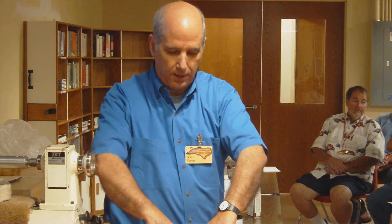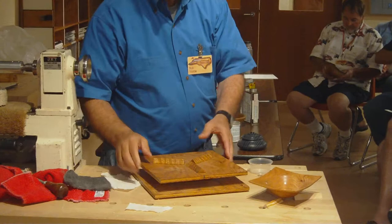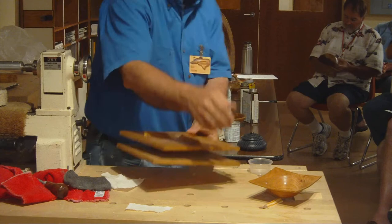Then I'm done with this. Out there it'll dry in a couple of hours, safely. This is handy for pretty much anything - I can take these things out and put bigger things on them. But I like my little Lazy Susan setup. Then it sits there and dries overnight. I just let it dry overnight, do my sanding, put another coat on. You don't have to sand between coats if you do it right - it's going to build up nicely.